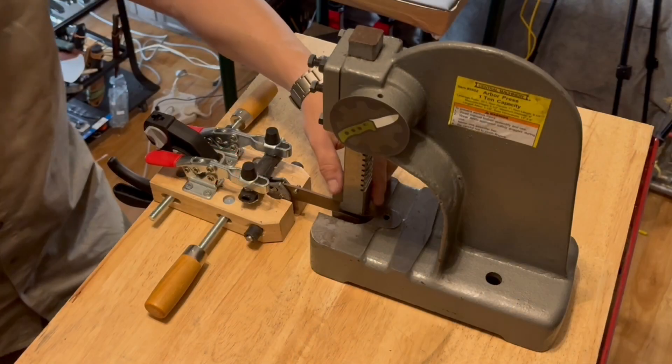Let's take a short break from Rockwell hardness testing and look at the differences between the old knife on the right and the new one on the left. Starting with the bronze washers — the size changed; they became smaller. There's evidence that Benchmade used to know that countersunk screws exist and not every screw has to be a button head. This is a beautifully made D2 blade — yes, I put D2 and beautiful in the same sentence; I like this steel. They removed the cavity that was required for the old Omega spring because the flat spring fits flush with the liner. Another difference: the stop pin is fully captive on the new model and a free-floater on the old model — it's an improvement.